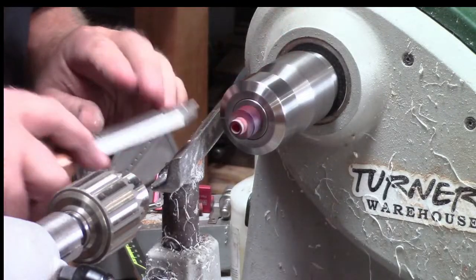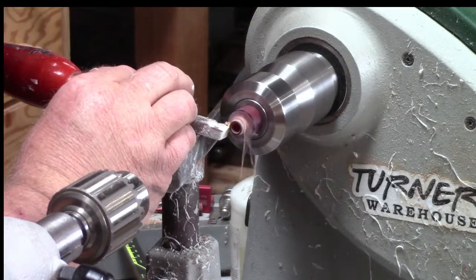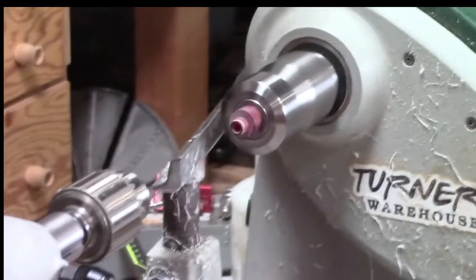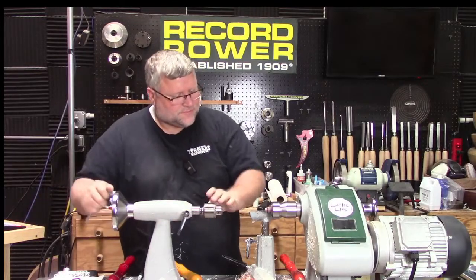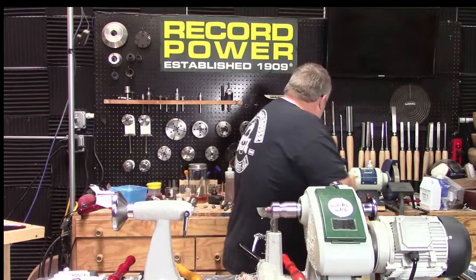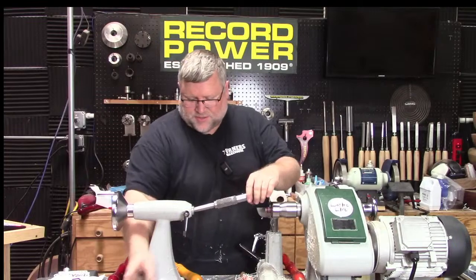Okay. Now, that actually looks quite crooked, so I'm going to use this to flatten it out. That should work. Okay. So we can do our outside threads here for this tenon. Again, it's an M10. These are M10 by 1. This is for the M13. You could do bigger, smaller, depending on what size you're using. All right. This is the niche system here.